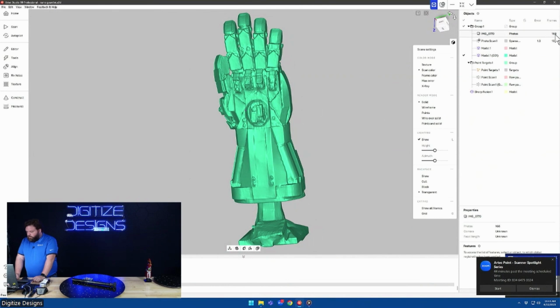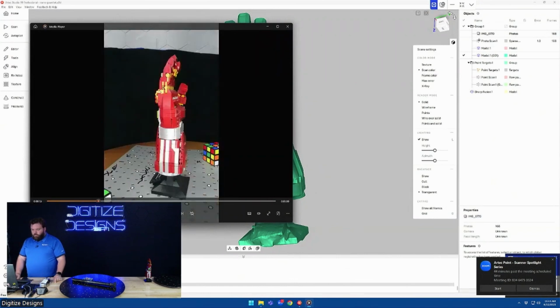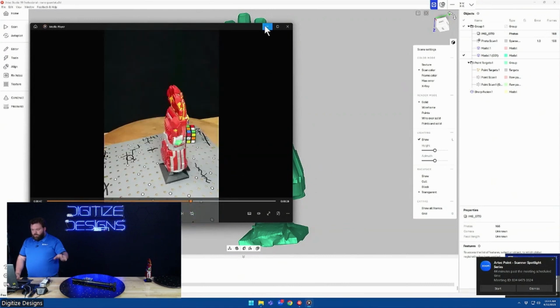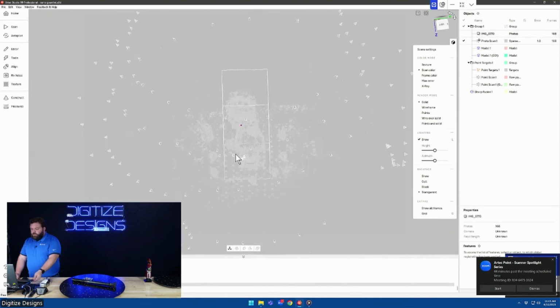So you brought in, in this case, it was 168 photos, and those I actually automatically extracted from a video. So instead of having to click, click, click photos, I just set this on a turntable, spun it around, and I can show you the video on its own. There it is. So set it up here on a turntable, spin it around, and then you drop that in Artec Studio, will automatically extract individual stills from that and drop them in here. You run it through 2 processes that do take a few minutes to crunch, but first thing it does is finds the position of all those photos.